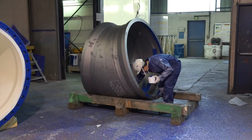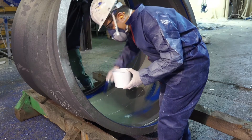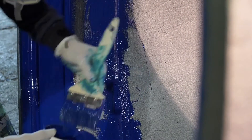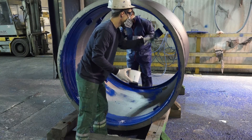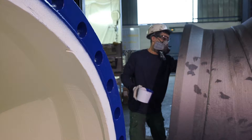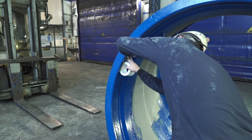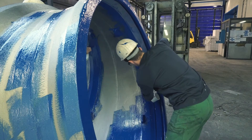For the socketed fittings, the 48-20 epoxy bi-components is applied by brush in the socket and on the areas difficult to coat, in the low-temperature oven following the prescriptions of the STRF 13-06-01 technical specification. A mask must be applied on the socket area before the polyurethane coating to protect the epoxy.